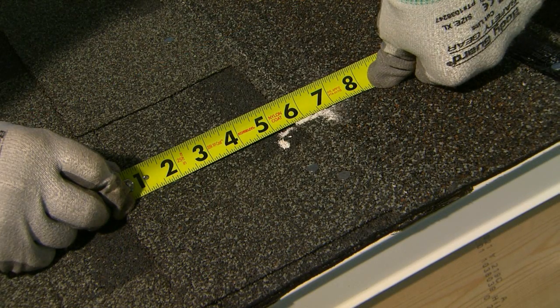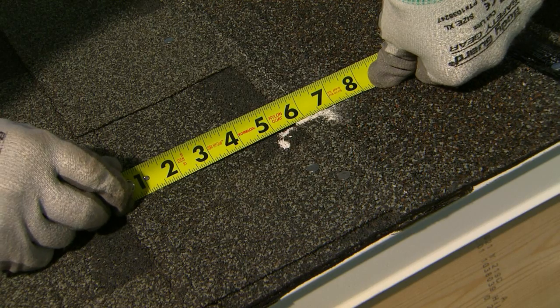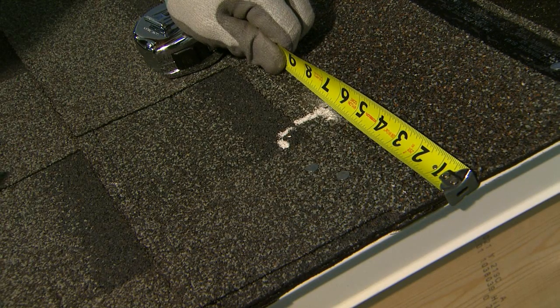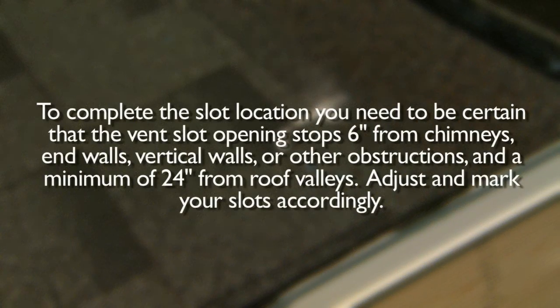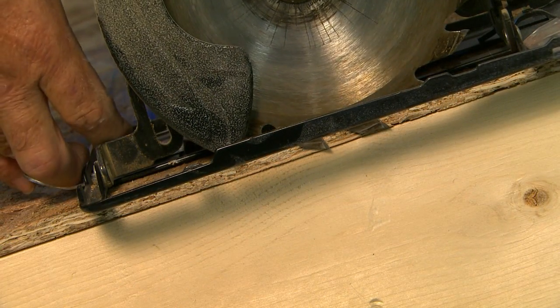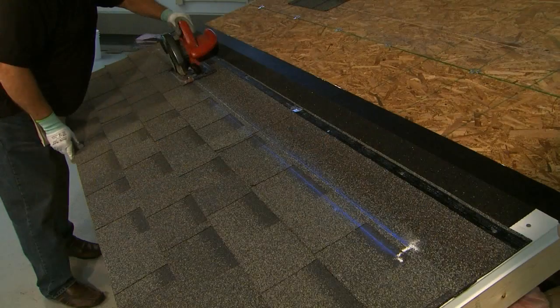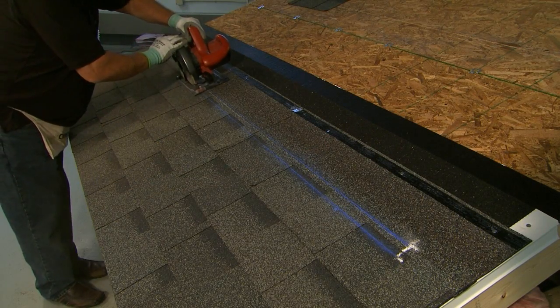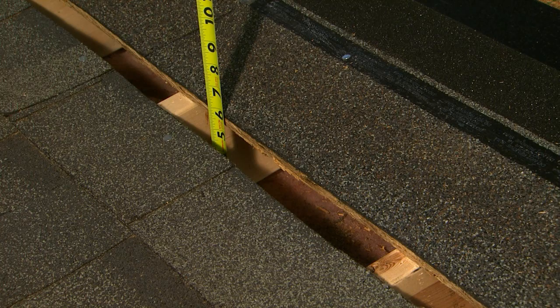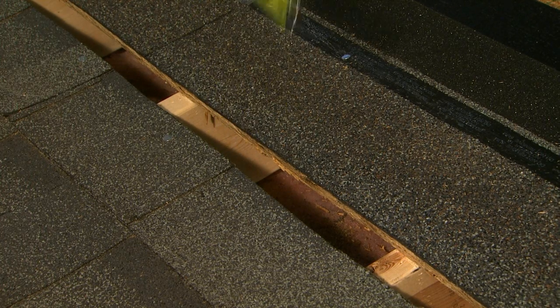Make a mark five inches above the lower edge of the last course of shingles installed, and a second mark one and a half inches above this line. Also make a mark six inches in from the gable end wall at each rake edge to identify the ends of the vent slot opening. Chalk a line connecting the markings for the vent slot opening. Using a circular saw with a depth set to the thickness of the roof deck, cut and remove all materials from the vent slot opening. Look inside the slot to be certain that any attic insulation is at least one inch below the surface of the roof deck to assure proper ventilation.